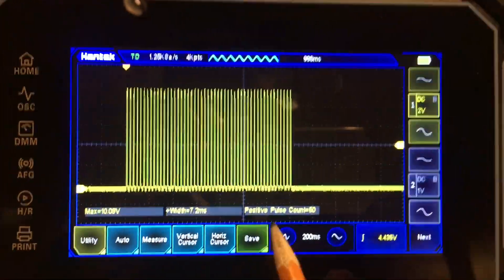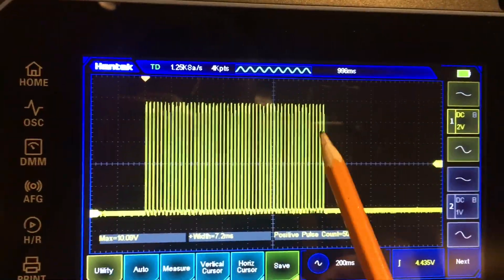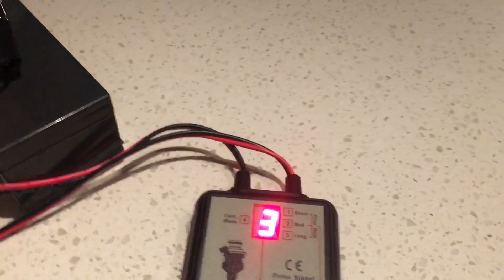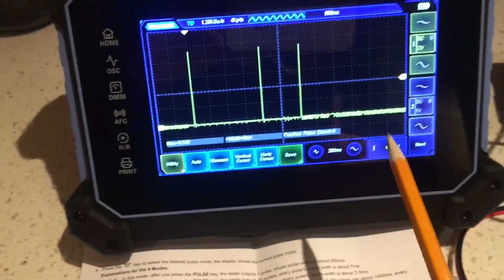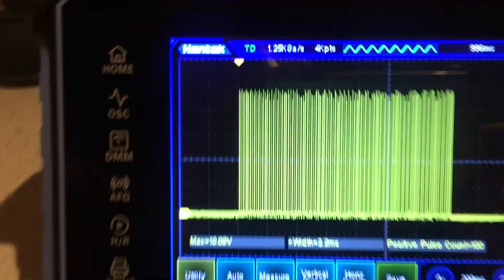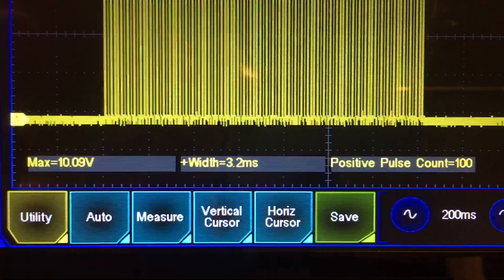This is the point of this video — the automatic measure function is quite good and could be quite useful. In the past when I first used this scope, it's quite difficult to actually count these pulses manually. Let's go to Mode 3: remove the power again — be aware of the random pulse — and Mode 3 says 100 pulses with a pulse width of about 3.5 milliseconds, so twice the number of pulses at half the width. You can see the LED pulses being generated and the scope paints the trace. Pulse count: 100, and very close on the pulse width.